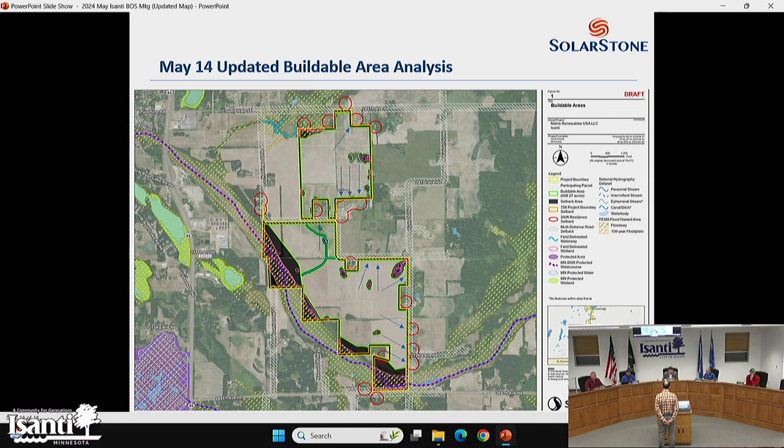Okay. But that's fair. To answer your other question, this isn't going to be a sea of panels stacked next to each other. The row spacing is about 20 to 23 feet in between each of our racking systems, which will be a long single-axis tracking system. They'll face this way. The panels will sit here. They'll tilt like this throughout the day to track the sun, to try to improve the production that comes off.